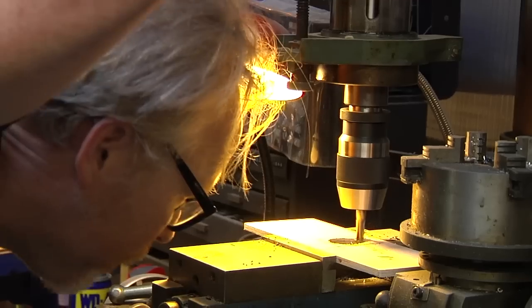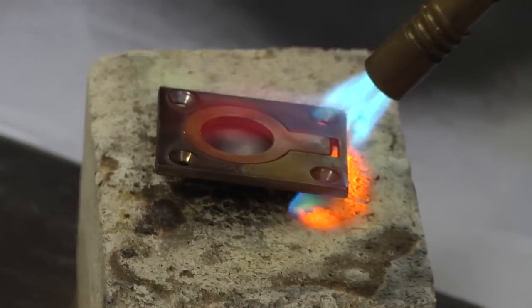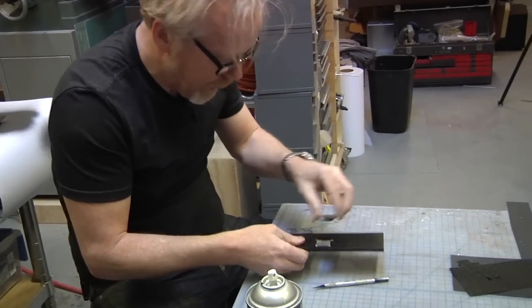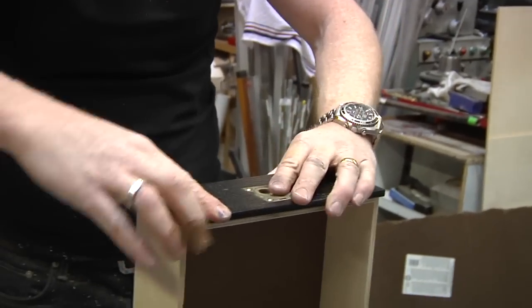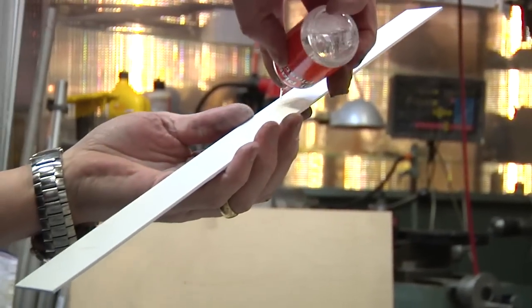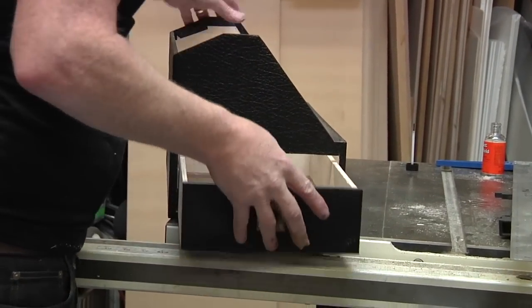Now I'm cutting out a hole for the hardware. I found this really nice brass door pull at Center Hardware here in San Francisco, and in order to sink it flush against the surface of the drawer I'm using my mill. There's the piece of hardware — I'm discoloring it so it looks old. I use my milling machine to mill out a pattern that fits it so it sits flush with the drawer. Now I've put it in and it fits almost perfectly — and doing this kind of thing, when you finally put the piece in and it fits, that always makes me really happy. Now I'm gluing in some drawer slides and using styrene to come out from the walls to guide the drawer. I'm using styrene because it's low friction and it's a quick solution.